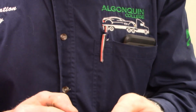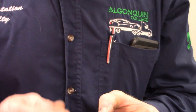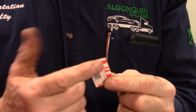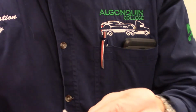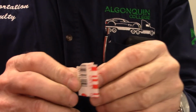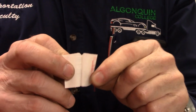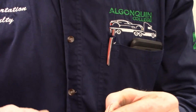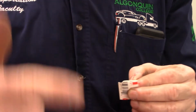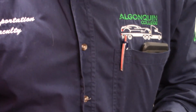The other thing, and the last thing, before you put the cap back on, you take your fingernail or a soft cloth and you wipe all of the residue of that piece of plastic gauge off of the shaft. All right, if you leave it in there, it kind of acts like a windshield wiper, and every time it goes around, it's going to clean the oil off for you, which is not good for your engine. All right, and that is that.